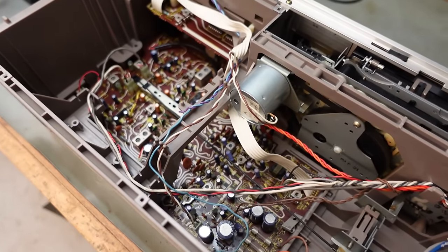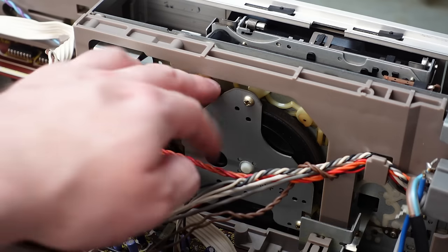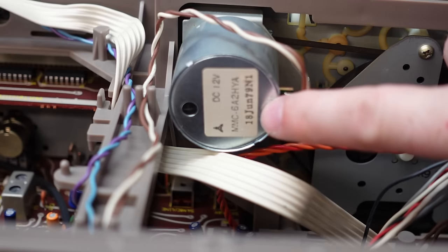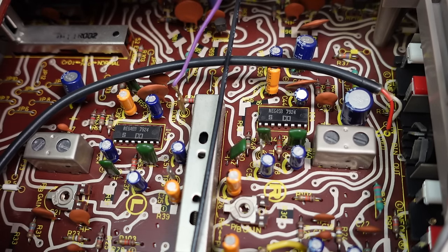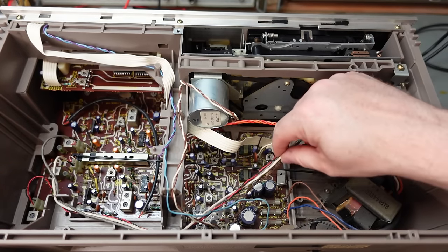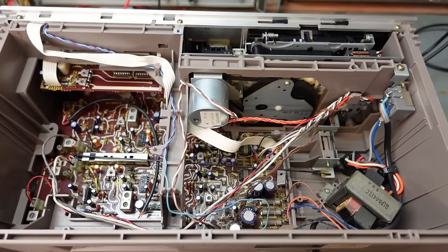This is very retro, proper old school - single-sided PCB and loads of discrete components. Are there any chips on here? Oh, there's a couple. This is a proper chunky mechanism. I'm thinking this is actually a 1979 model - the motor is from the 18th of June '79, the transformer's got '79 on it, and both Dolby chips say 7924, week 24, 1979. There's only one motor and the tape head outputs are on separate leads with their own plugs.